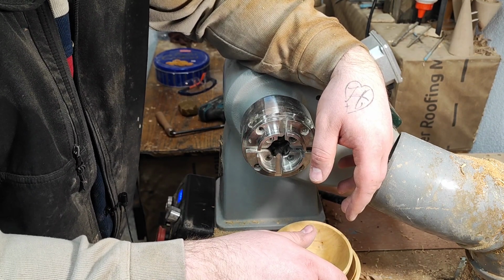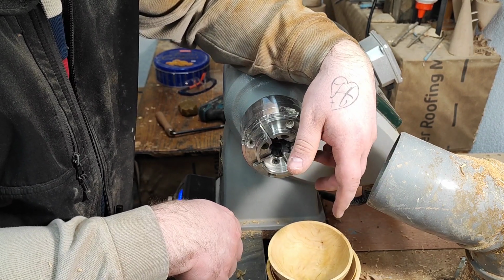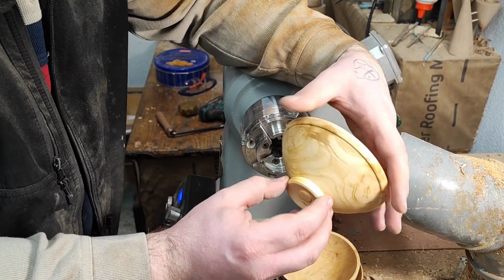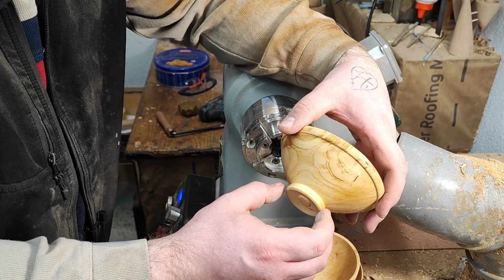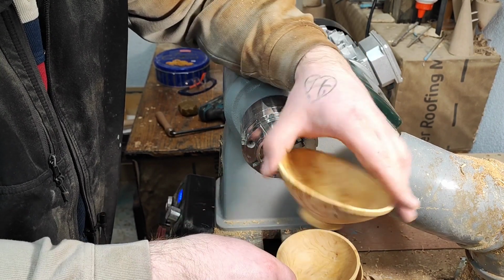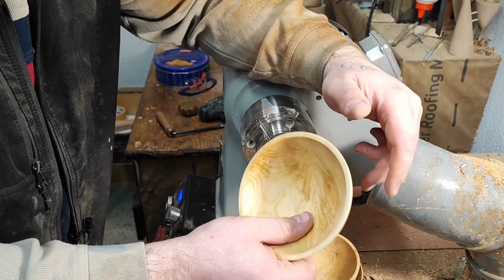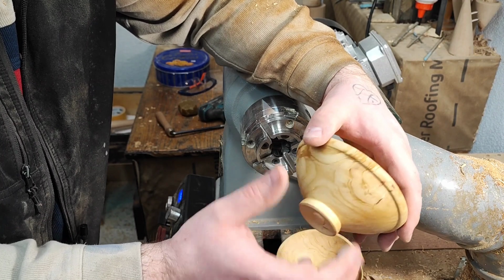So what I usually do, thank you Rich by the way, and thank you all for your support, is start with sort of a design in mind. I start with: is it more decorative, is it more functional? If it's more functional, then I would leave at least 1/3 of the diameter for the base, in proportion, to be more stable if it's going to be used more. Platters, you can go up to 50%, so that's sort of a design already set in, sort of.